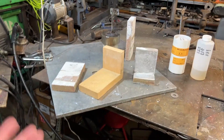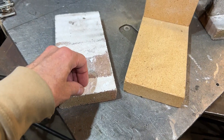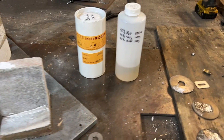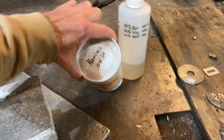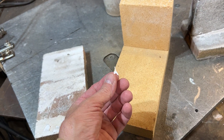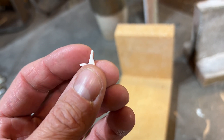I didn't really discover it — I'm sure somebody else has done it a hundred times before. But I was messing around with some different ingredients the other night, and I mixed some potassium silicate water glass with some 2.5 micron aluminum oxide. I let it dry out completely, and then I fire cured some of it. I ended up with a material that's harder than glass.